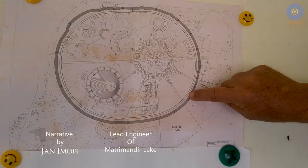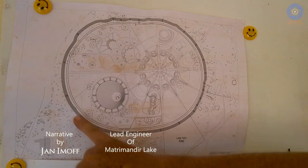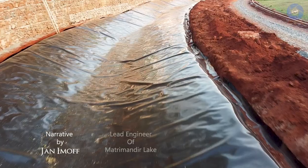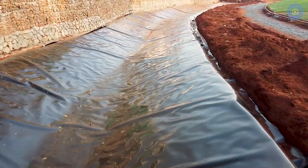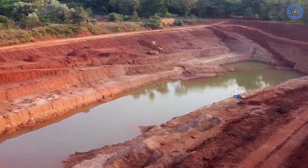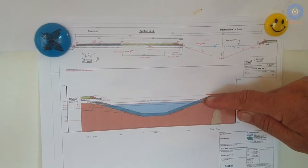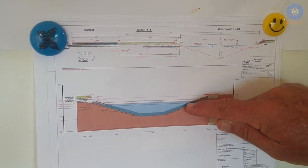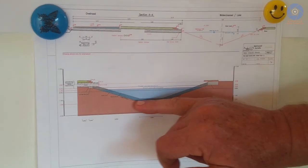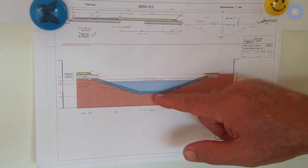This is a channel that we have now just foiled in the last ten days, all the way around the inner garden, and it terminates on either end of the test lake so that the water can flow into the lake. The section of the channel is seven meters wide. The shores slope down at one in three, and at the bottom we have a short horizontal section. The channel is one meter twenty-five below the road.